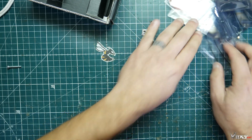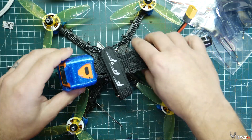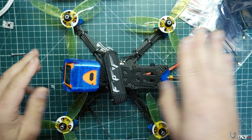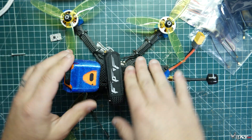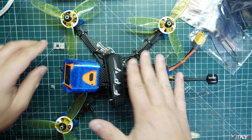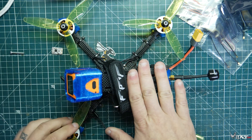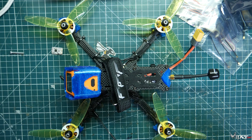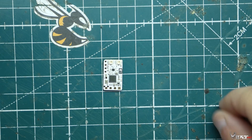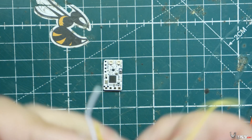What we're going to be doing now is wiring this up to my existing quadcopter — this is my Stark frame that I built recently on the channel. I'm going to take the top plate off, remove the old Crossfire receiver, and show you how I wire this one up. I'll be wiring it onto a JB F7 flight controller. I'm using red wire for 5 volts, white for receiver TX, yellow for RX, and black for ground.